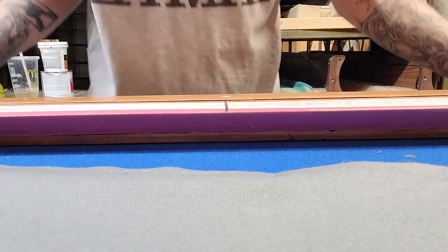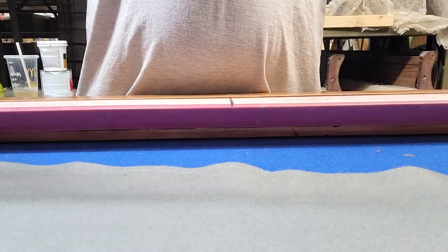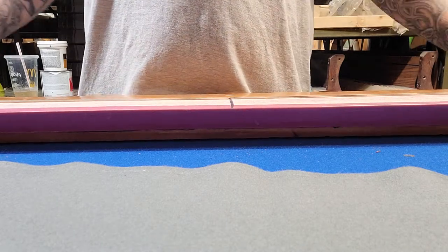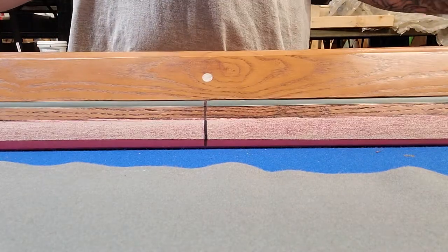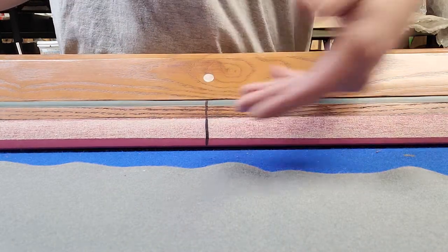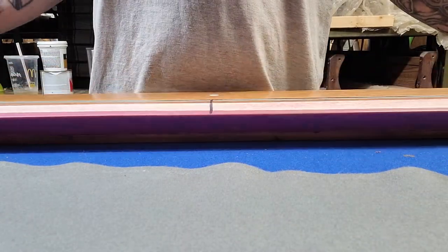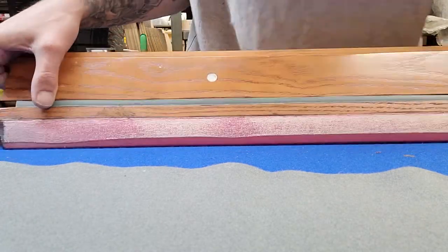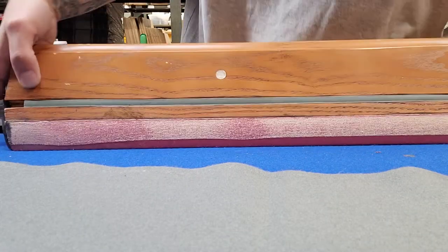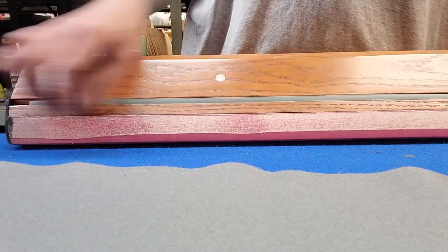As you can see here first, I made a little line right here. Alright, so you have your feather strip. So you take your feather strip while it's in the rail. And you'll see a line right here. If it's not already there, take you a marker, make you one right there in the center. So, at the ends, this is a rubber one. Sometimes you'll have wood ones, but this particular rail has rubber feather strip. So I have to stretch it as we go to pound it.